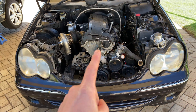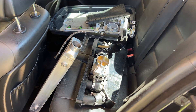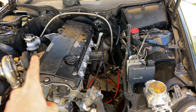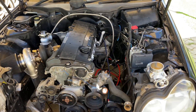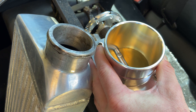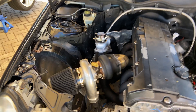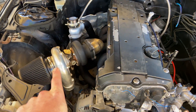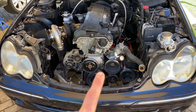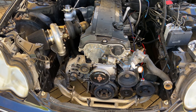This was a very big step I wanted to get out of the way before getting into a few other smaller upgrades, like adding a 76mm throttle body to the intake that I built. The current setup is still running the 67 millimeter stock M104 throttle body. Another thing is I want to do a few upgrades to the intercooler system and its piping — nothing major, just some small improvements. And I know I said I'd get those coolant lines into the turbo, but I'm still wrapping my head around the whole cooling system because that's also going to be changed.